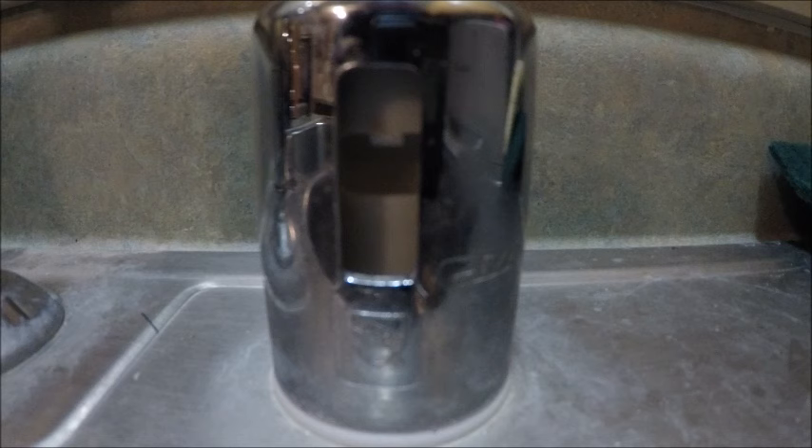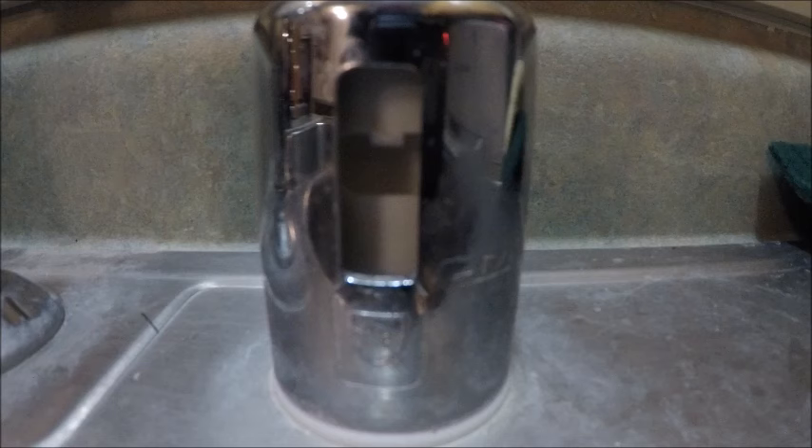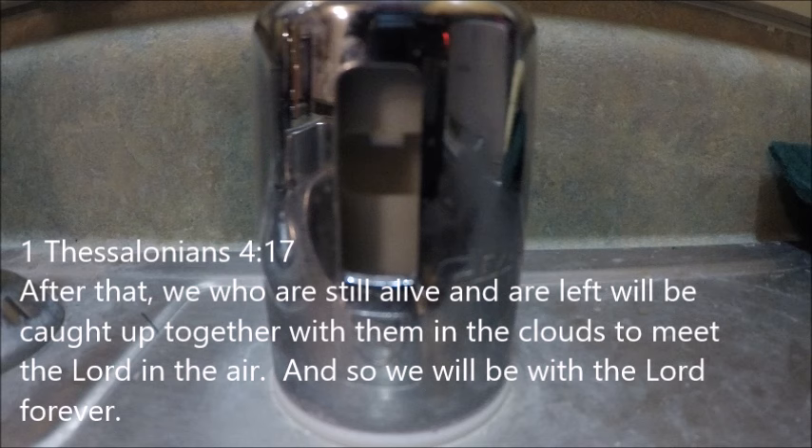So here we are on a drain cycle, and so far so good — no water coming back up through the air gap. It's looking like unclogging the hose worked. Everything's looking good still, and no water is coming back up. Looks like I got enough of the gunk pushed out to stop any water coming back up through the air gap. Hopefully this video helped you. Thank you for watching and have a good day.